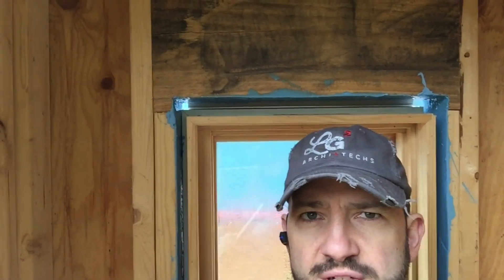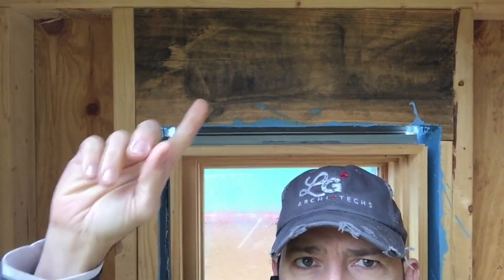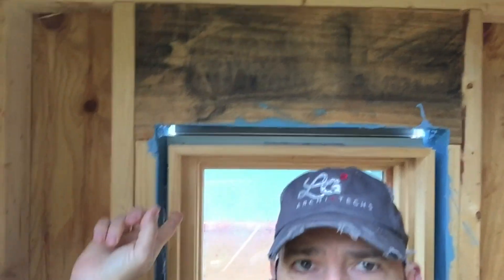When you have rough openings, though, and the window detail leaves you gaps like one inch here, or in this case three-quarter inch, you end up having to use a lot of backer rod and a lot more sealant. And that sealant is not inexpensive — roughly about $20 to $30 a tube. Sometimes when you have a gap like this, you may end up using an entire tube on a window. So we've chosen a tape.